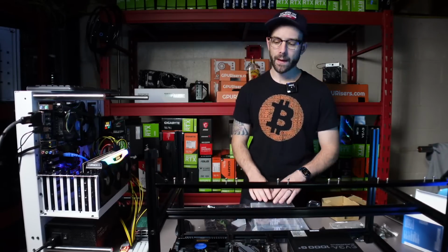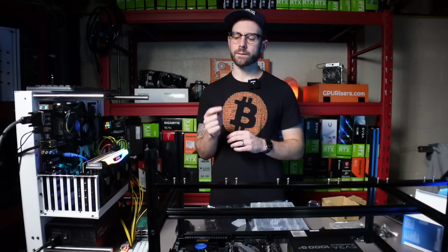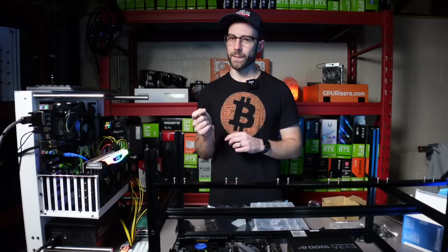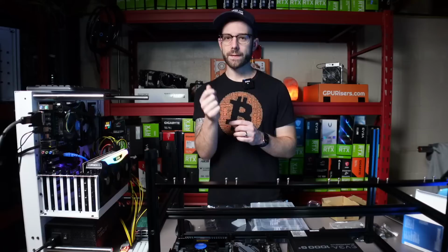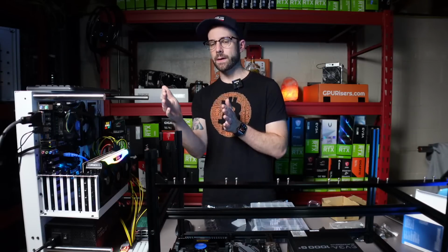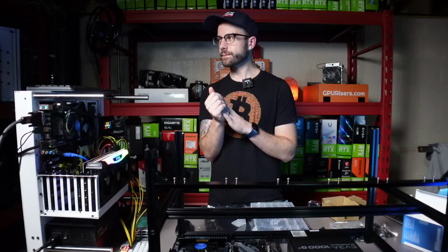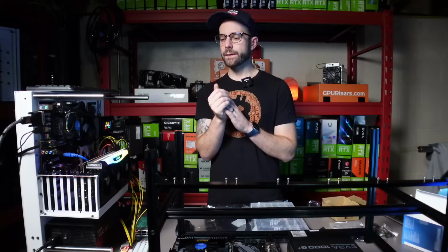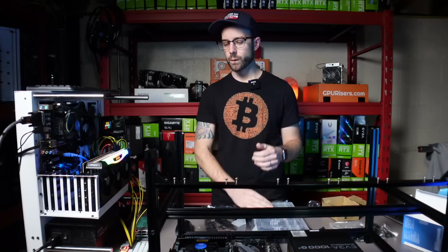Why I've been thinking about it more is I have the 12-card GPU rigs in there, and I guess there might have been an epoch change and the DAG size of ETH grew a little bit. It grew just enough to be over the virtual memory that I set up in Windows, which is already pretty much maxed out on the 120 gig hard drives I have on those rigs. So I couldn't get all 12 cards mining because I ran out of virtual memory.